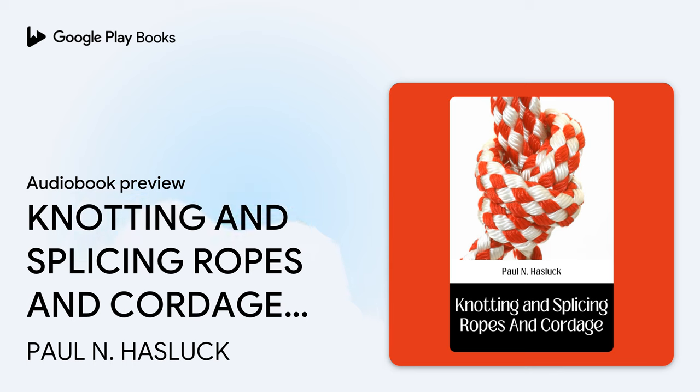If the fibers of which a rope is composed were laid parallel to one another and fastened at the two ends, the combined strength of these fibers would be utilized to the full. In other words, they lose strength by being twisted or laid up. But on the other hand, the length of the fibers being at most but a few feet, their usefulness in this state is very limited. For this reason the fibers are first twisted into yarns, these again are laid up into strands, and finally three or more strands are formed into a rope. As twisting diminishes the strength of a rope, it is important that the yarns be carefully laid up, so as to bring an even strain on every part. It should not be laid up too hard — it should only have sufficient twist to prevent the fibers from being drawn out without breaking.